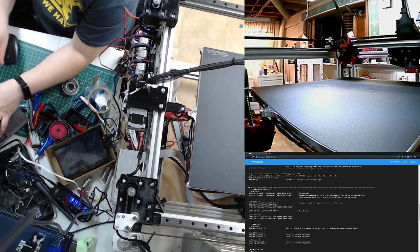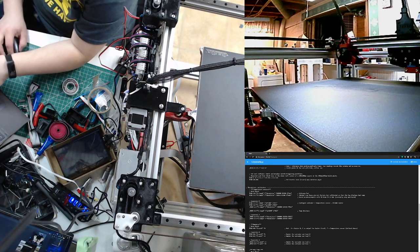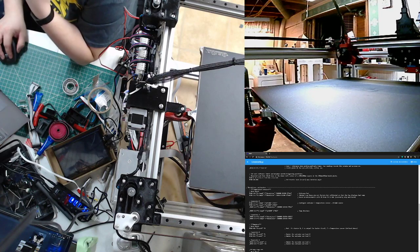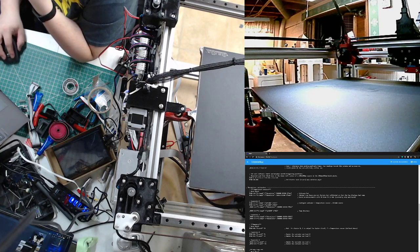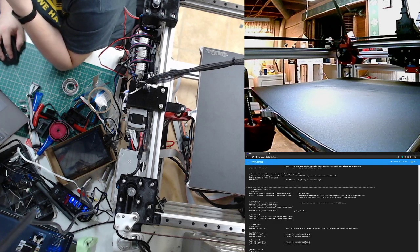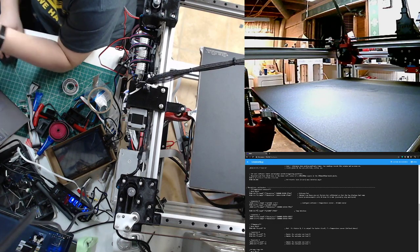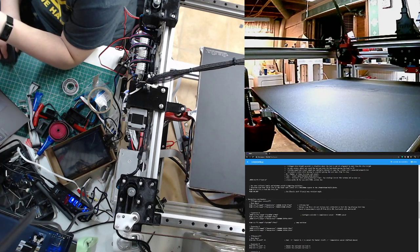With that 25 millimeter shaft, I worked out that I needed a 7 millimeter spacer. Wow, are they really that different? I thought the Stepper Online ones were 24 millimeters. Well, they're not really. The CAD model you have is 20. The other thing is that in the CAD model you've got the lead screw and the motor shaft up against each other.